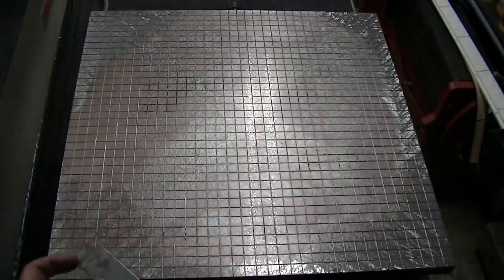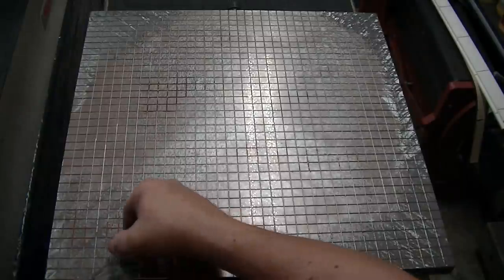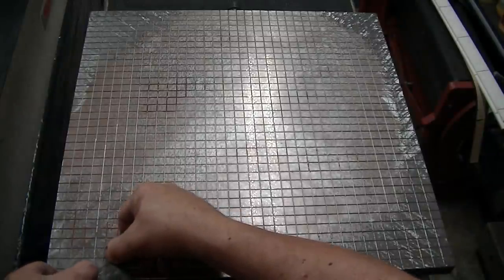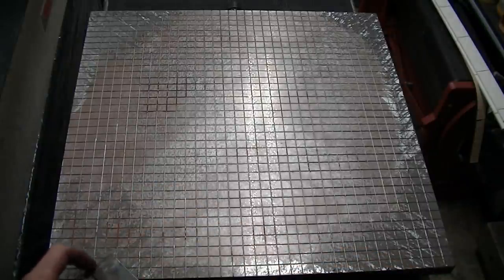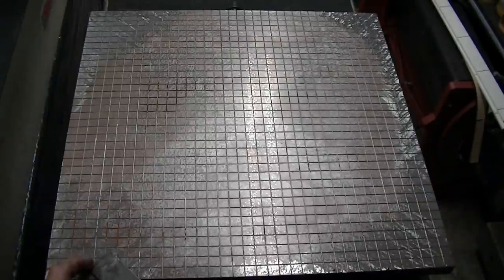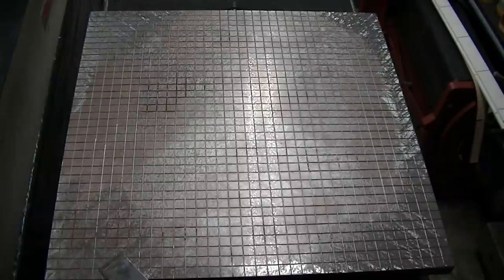The advantage of the wider scraper is you can get a wide cut. Some of these cuts that I'm doing are almost 5/8 of an inch wide. Well, if that's on a 3/4 scraper, it gives you very little margin of error for starting to come up and hit the edge. The extra width of this scraper allows me to get an almost 3/4 wide cut when I get super shallow like this, which is what I'm trying to do.